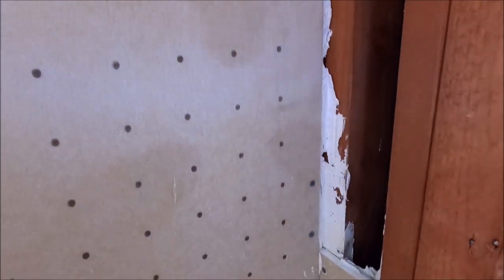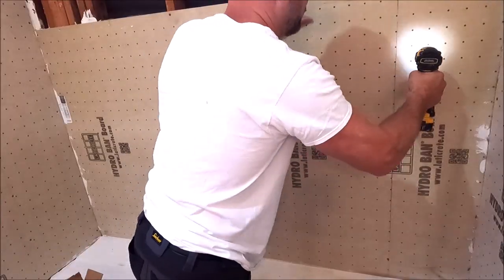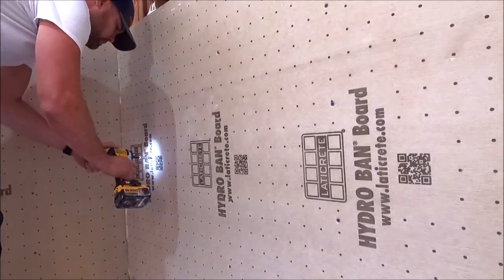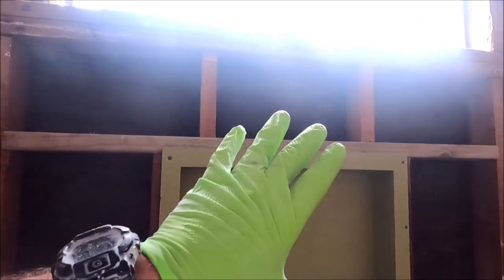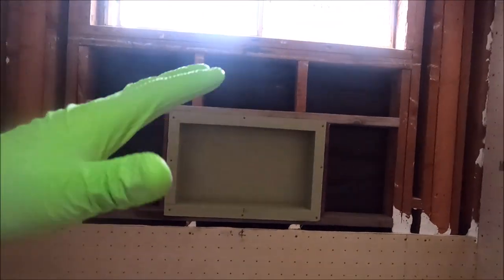You see how the screws go through the thinset without problems and the board is not getting sucked in — it is going to stay plumb and stay flat via wet shim. It is now time to finalize the wet shim for our back wall. The board is cut and ready to go, dry pack is installed, our niche placement is where we want it, the niche is framed, and the prefab niche is installed. Now it's time to finalize our wet shimming on these studs and install the last piece of board for flat and plumb walls.